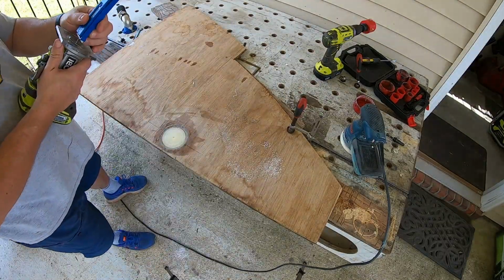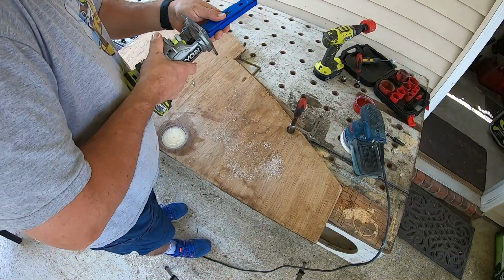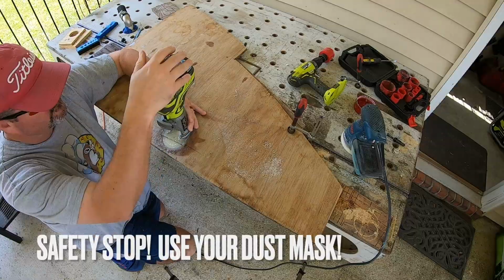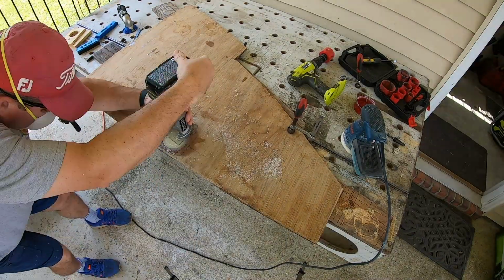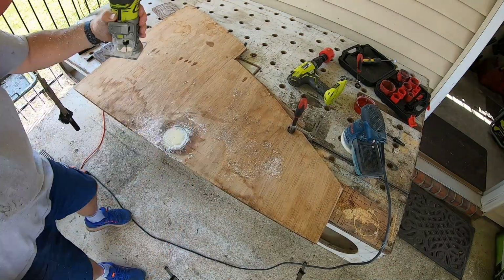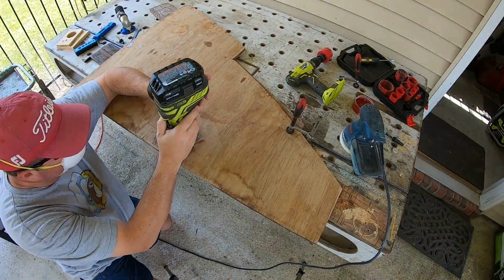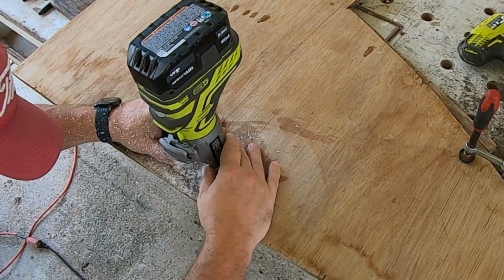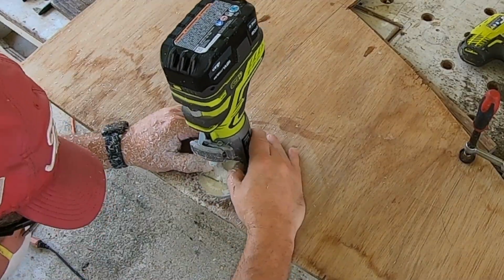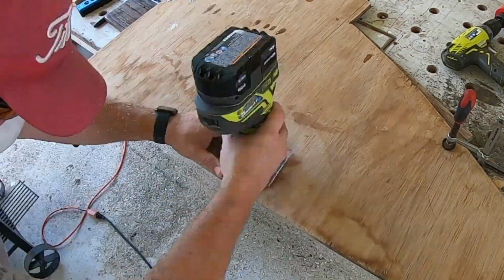So as you can see, I didn't completely drill that smaller hole out. I just kind of scored it a little bit, and now I'm just trying to set the depth of my router. That's a vertical cut bit in that router, and all we're doing is just moving it back and forth and using that kerf of that hole saw to stay away from that edge, so I keep a nice clean edge. And here you can see, little by little, me whittling away at it. What I'll do probably next time is go ahead and drill the smaller hole as well, and then I just have to worry about the ring between the outside cut and the smaller hole. So it'll be a little bit easier. I won't have to have that middle part right there.